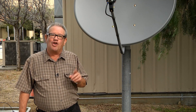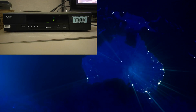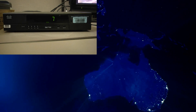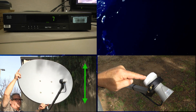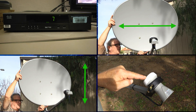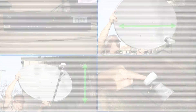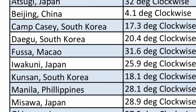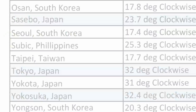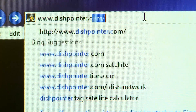Download and print a copy of the PDF from myafn.net explaining the settings for your receiver model and dish orientation. To get the signal, you'll be required to perform four actions. One, change the settings in your receiver. Two, adjust the LNB. Three, move the dish vertically for correct elevation. And four, move the dish horizontally according to the azimuth. To do this, check the aiming guide on your PDF. If your location is not covered, you'll need to use a dish pointing utility such as dishpointer.com.